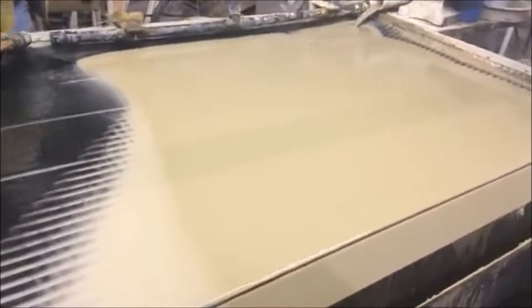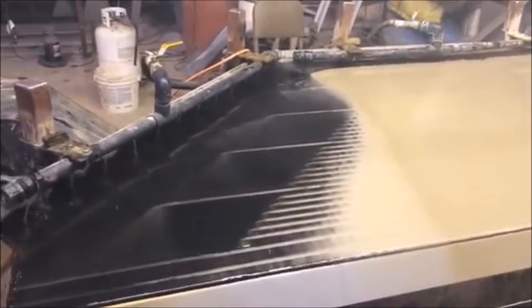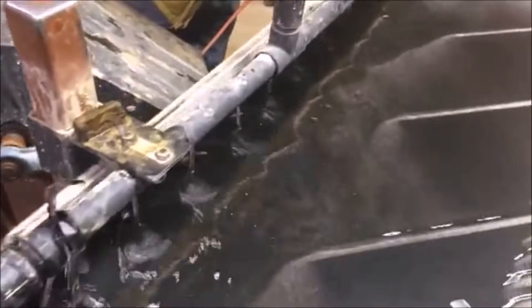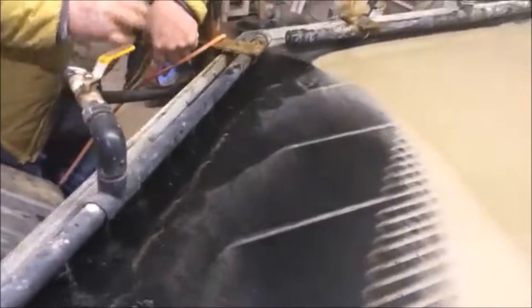It smooths out nicely and evenly, and we're getting the blond sands down into the tailings trough. When we load it up with pyrites, we get pyrites coming down into the concentrates trough out the ends of the grooves. We've got a gold line here under the water bar. There's quite a bit of steel coming off the ball mill that they're going to capture before it gets on the table.